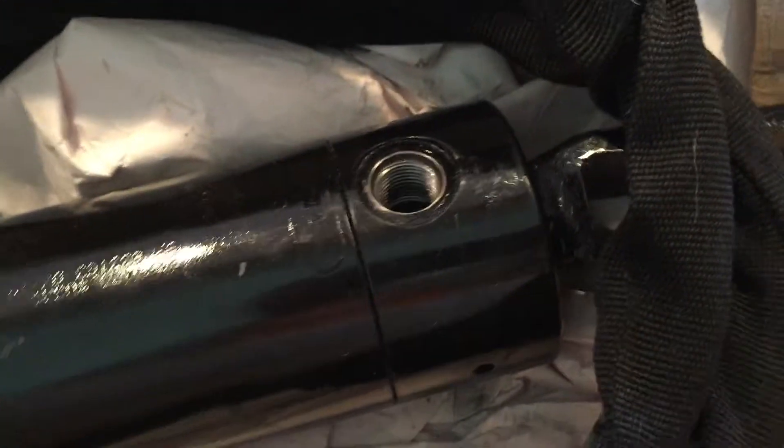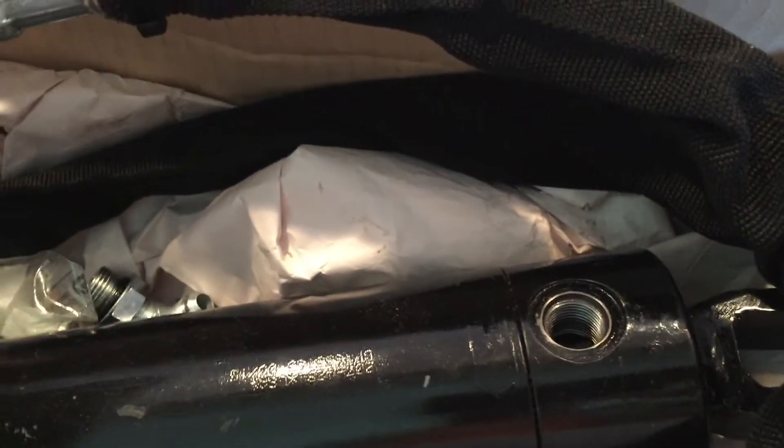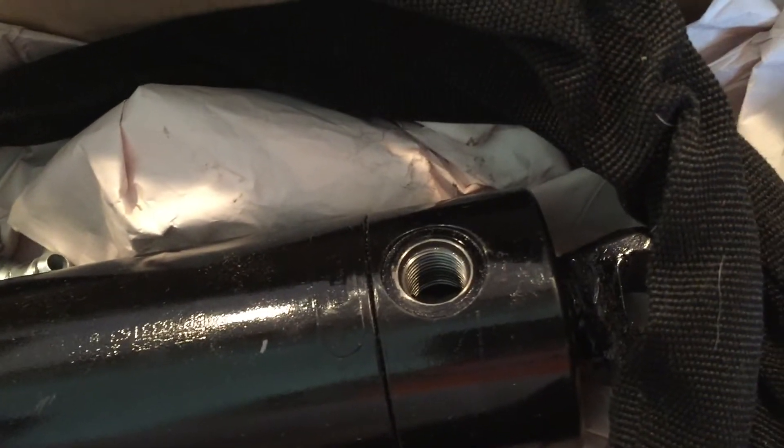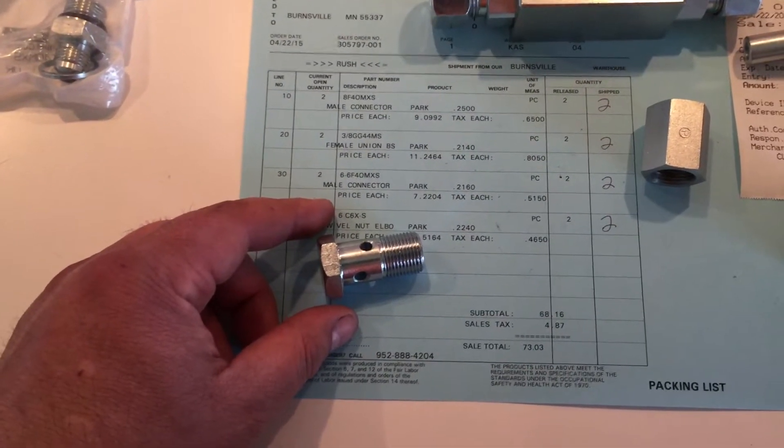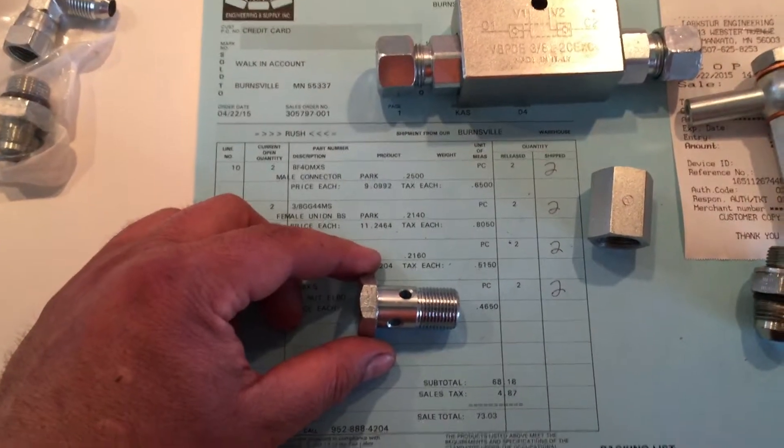To make this work, this recess is an SAE standard American equivalent 8, and the banjo nuts are 3/8-inch British Standard Parallel 19. So I need to go from SAE-8 to British 3/8-19, and in order to do that I have to go through a few adapters — as far as I know, a single adapter doesn't exist.